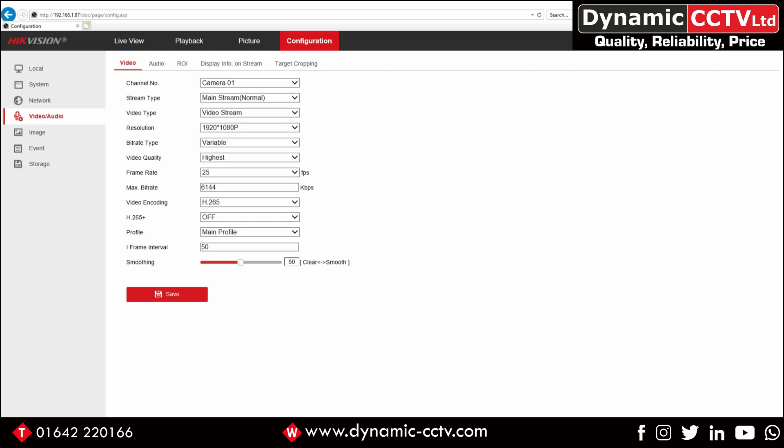Down to the Video and Audio tab you can see pretty much the same as any Hikvision web front-end camera interface in terms of being able to set the stream characteristics. The difference is you've got the option for all four cameras, so you can set stream parameters of each camera module independently in terms of frame rate, resolution, bit rate, and codec. We've got them set to 1080p at the moment, but as mentioned these are 5-megapixel cameras so you can set that all the way up to 5 megapixel.